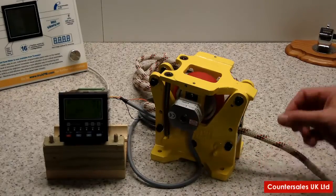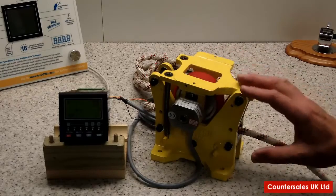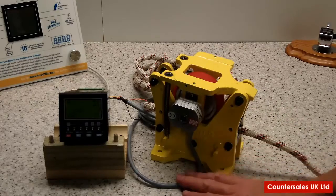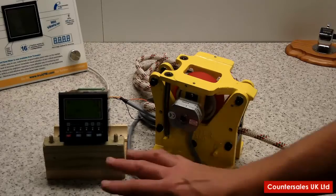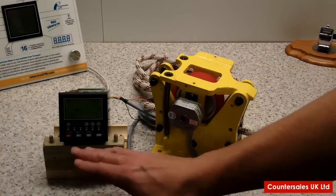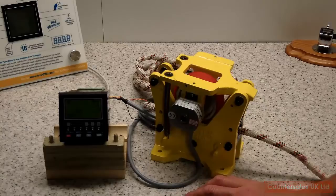So really, if you're after upgrading from mechanical measuring systems, something like the 2630 or 2600, it's fairly easy. An encoder gets fitted — we can arrange that. Standard encoders come with two metres of cable, but if you want longer than that we can specify that at the time of doing it for you. This is just to show you the example of turning your mechanical measuring system into an electronic one, which is fairly straightforward, and we can help you out with that.